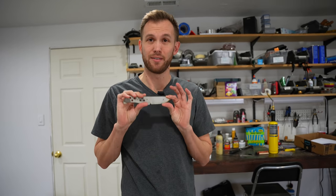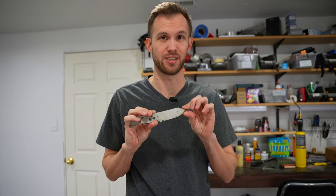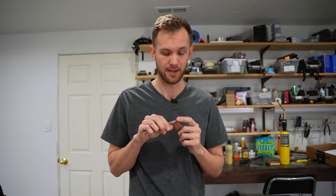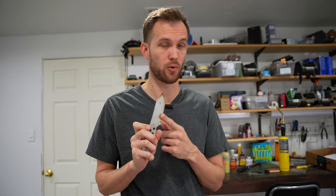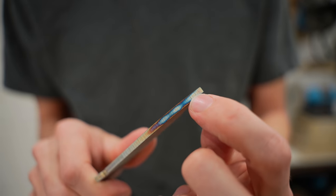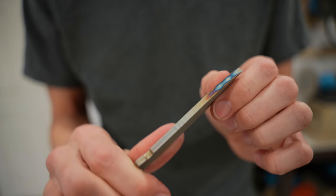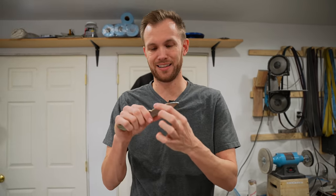The heat treatment on the knife is done. I did the tempering — that was two cycles of going into the oven at 400 degrees Fahrenheit for two hours each, letting it cool down in between, and I also threw it into the liquid nitrogen, which is supposed to maybe help a little bit with the toughness of the finished blade. Now I'm going to do a quick test to see how hard the steel is to make sure all that worked correctly, and then it's on to grinding. To grind the blade we need to know exactly where we're grinding toward — right down the middle — so I'm going to smooth off the blade face and put a fairly smooth belt on the grinder to clean this edge up.